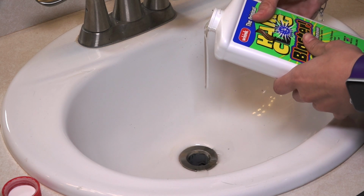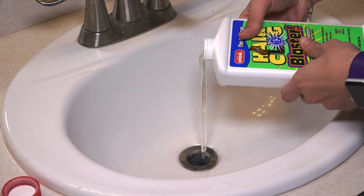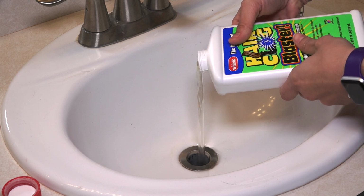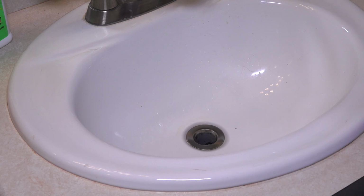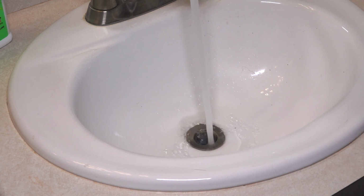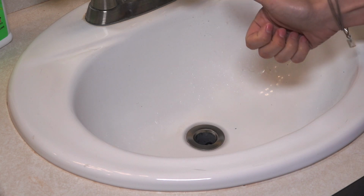This is just a drain cleaner and it says to shake it and then pour 8 to 10 ounces down the drain and then wait 15 to 30 minutes for it to do its work. So I'm going to do that right now. Okay, it's been 15 minutes, so I'm going to run some warm water through it. This is a good sign because before, water was standing when I let a lot of water in the sink, so I think it worked.